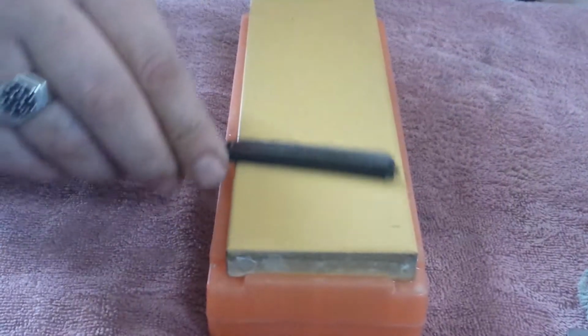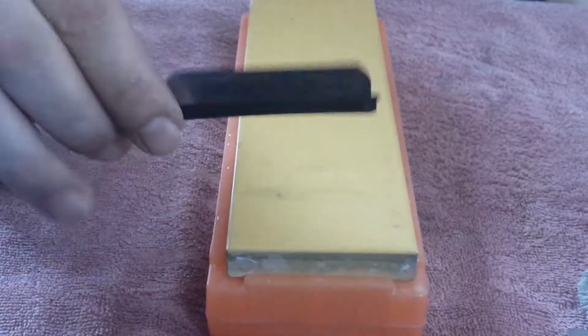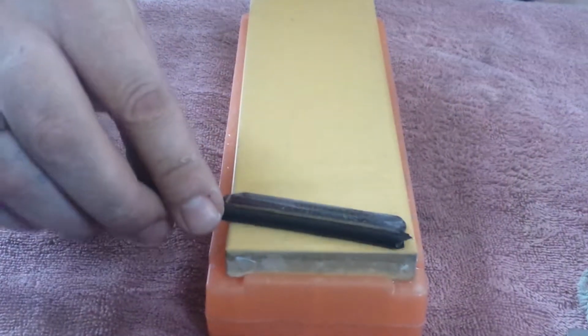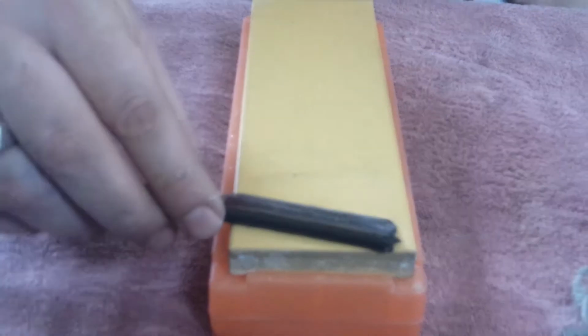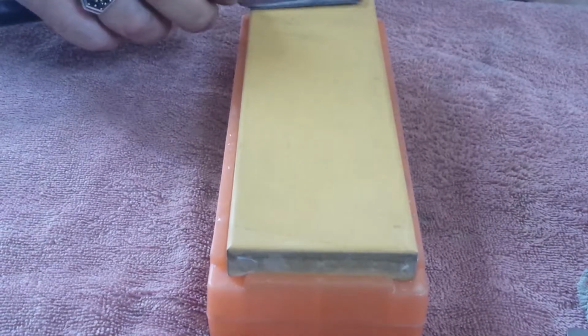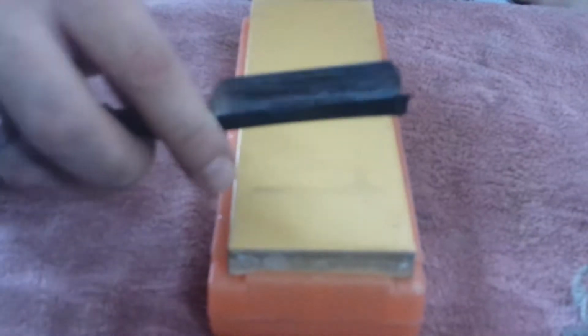Steel's hard, but aside from the honing difficulty, the fact that you have to do a lot of extra strokes to get your blade where you want it to be, once it actually has the bevel set and you've worked through your progression properly and you have an actual shaving, cutting, shave-ready edge, it lasts a long time. You can have a C135 shave-ready edge last, depending on the consistency of your beard hair, how you prep, and how often you shave, maybe a year before you have to go back to the hones, with just stropping and mild maintenance of the edge, unless you damage it, of course.